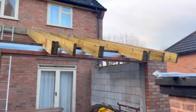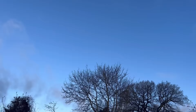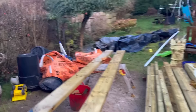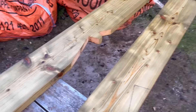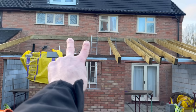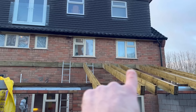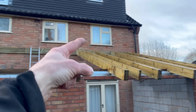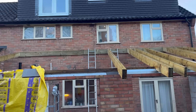You can see we've already got all the doubles set — everything is set other than the top and bottom of the velux. We're going to use the final rafter we already cut out for the lintel area, then cut the bird's mouth without that notch and continue across. We've got another velux to go in the middle of this window. After that, we'll bolt the timber onto the wall, put the wall plate straps on, put coach screws in the doubles, and then this is ready for lath and felt.